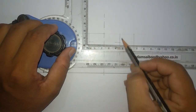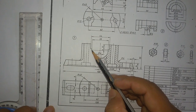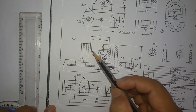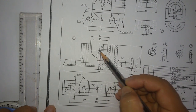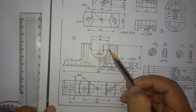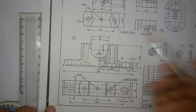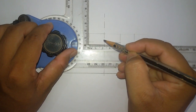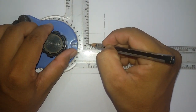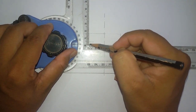The distance between these two inner lines is 12mm. Then you can see here a semicircle whose diameter is given as 38mm. The center of this semicircle is 3mm below this line. So first mark the center point 3mm below this line — this gap is 3mm.